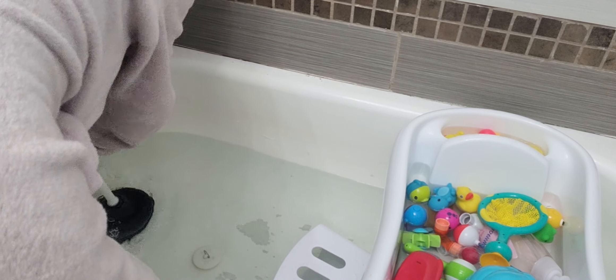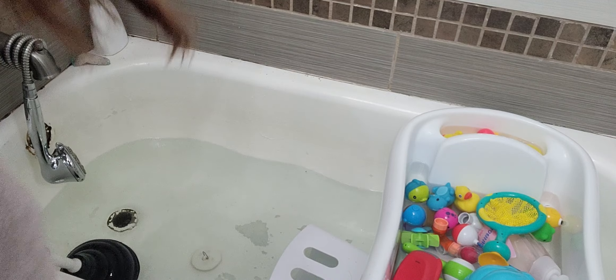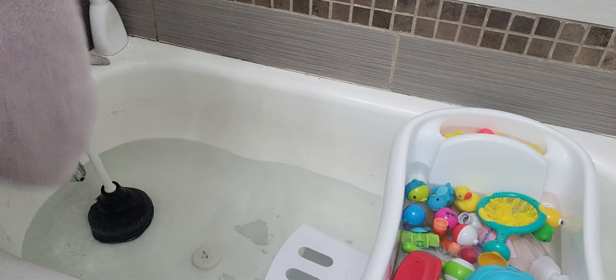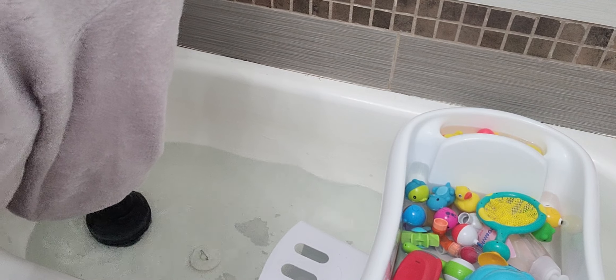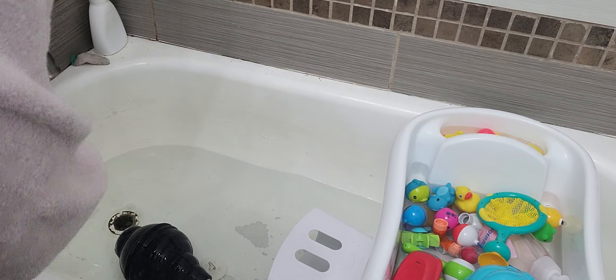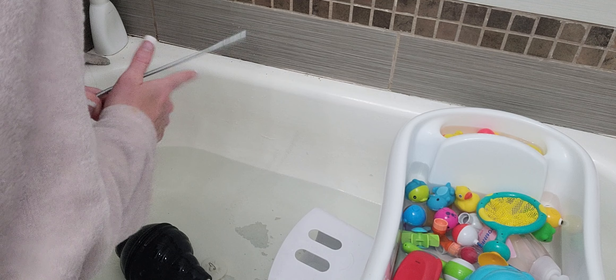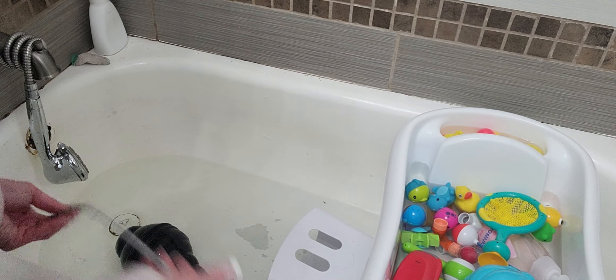What you're going to do is plunge this several times. If you have anything in there, you keep the cloth there and it would come up. You plunge here because if you plunge without covering that vent, it's not going to give you that suction to pull whatever is blocking the drain out. That's why you have to cover this to close this line up. And when you release, you're going to have a bunch of yuck come up. I always recommend having one of these little grabber catcher things — you could stick that in there. If you have the device with little pry things specifically designed for hair, stick that in to the best of your capabilities, wiggle it around, and pull it out. This is the best way — if you've had hair or anything like that in the drain, it would come up and you'd be able to grab and pull it. If it's a blockage, you'd be able to grab and pull that.